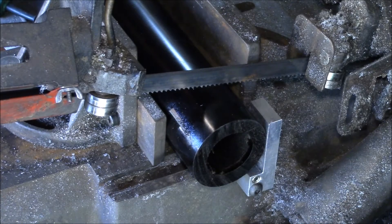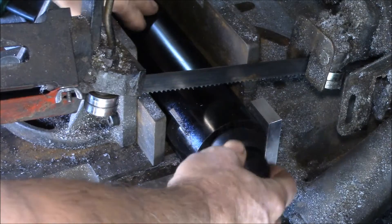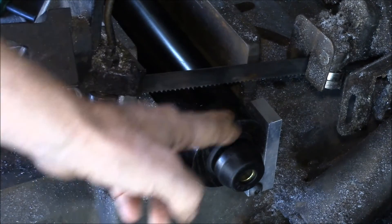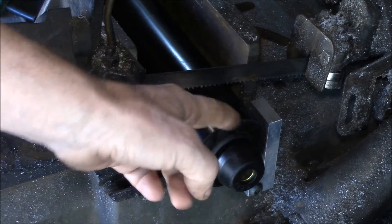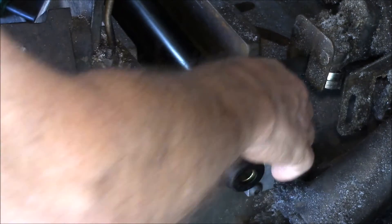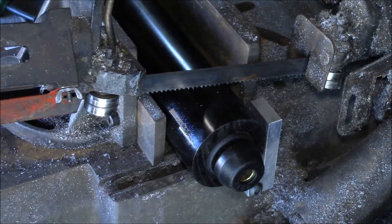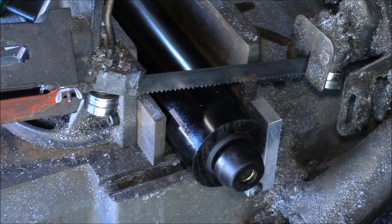The last thing I do is I have a little polyurethane bushing that I fit inside the tube. This bushing keeps the outside from collapsing, the fence keeps it from bending, and being supported on both sides behind, I get a really nice square cut. Let me show you what that looks like.